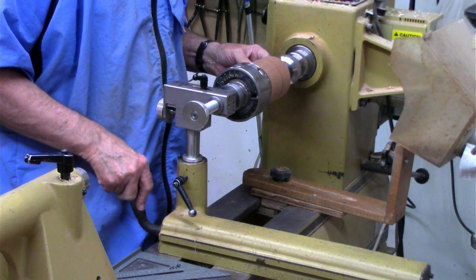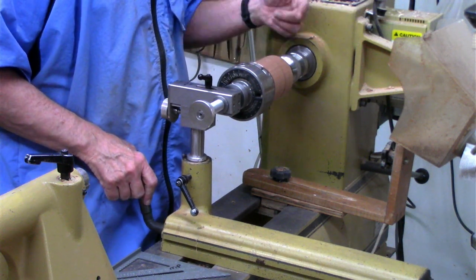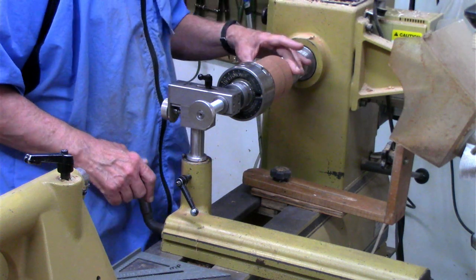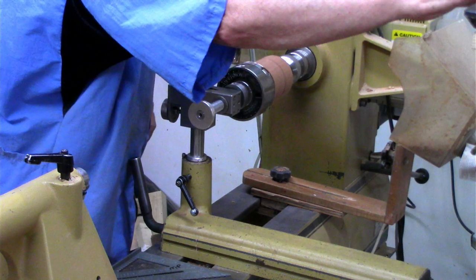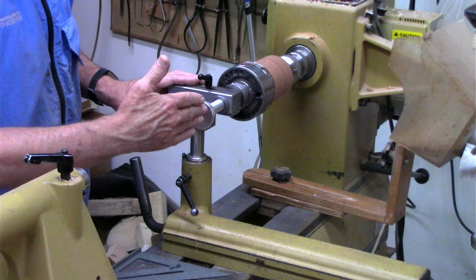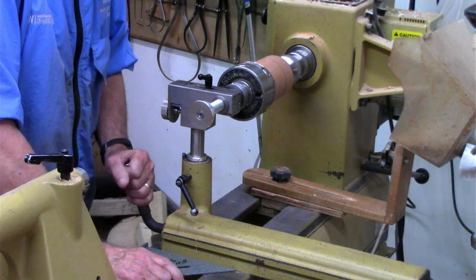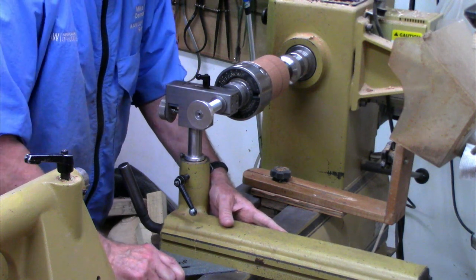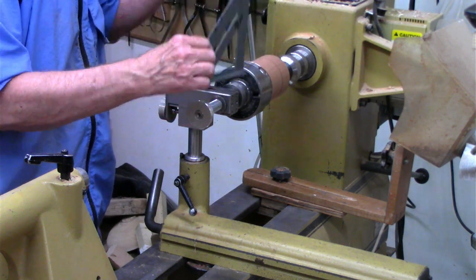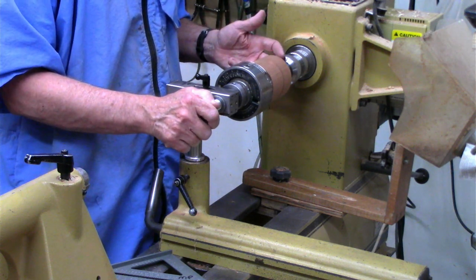The challenge when you go to set this up is getting the jig fastened absolutely parallel so you'll get even threads — evenly cut on both sides at the same diameter. I've had a challenge with that. There are a couple of ways I did it before and they didn't work as well as the trick I'm going to show you. First, I would visually line it up from behind the lathe, or try to square up the banjo using a carpenter's square as a reference, but from time to time I wouldn't get it exactly right and it would cut uneven threads.